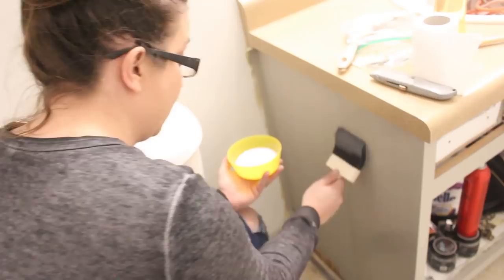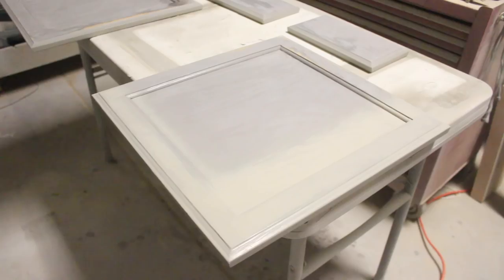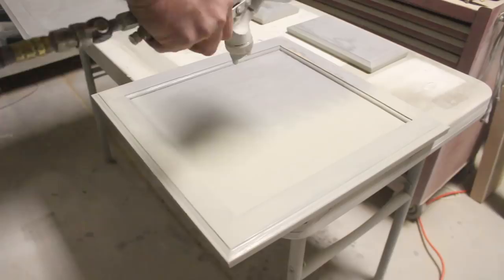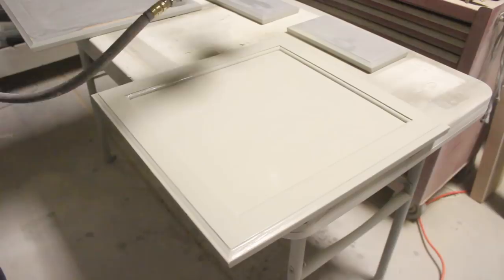This particular cabinet is between the toilet and the counter and will have a trash can and toilet paper roll on it, so I just want to make sure it's smooth when done. Since we're having to paint these twice, I'm going to spray the second coat of fieldstone right over the top of the letterpress gray with the spray gun — it should give one coat of coverage and dry real fast too.